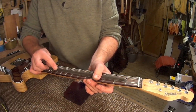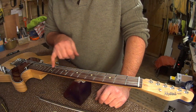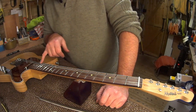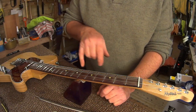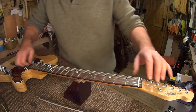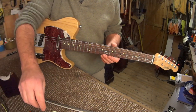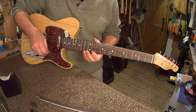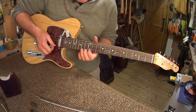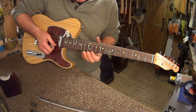Okay, so what I'm feeling on this is that these spots here, this number 13, is a very, very dodgy fret, and there are some out here as well. And these low ones here, we're just about getting into them at the moment, so we might hear a tiny improvement. But remember what I said at the beginning, that I've set the action as low as possible. So I've gone below what it was originally. I've gone down to 1mm here, so we've got room to back up to the 1.3 that Si had if we need to. So let's go down and, better.